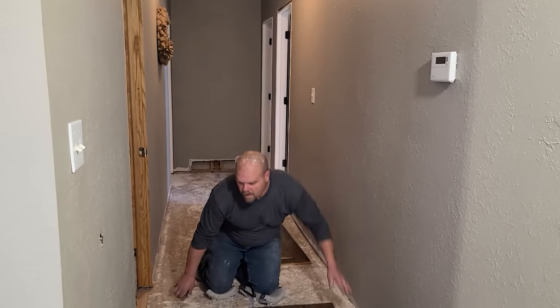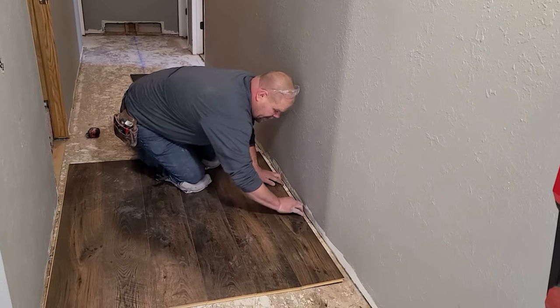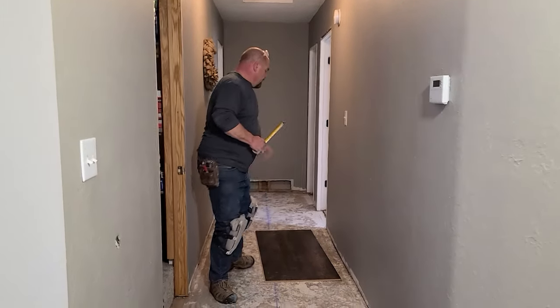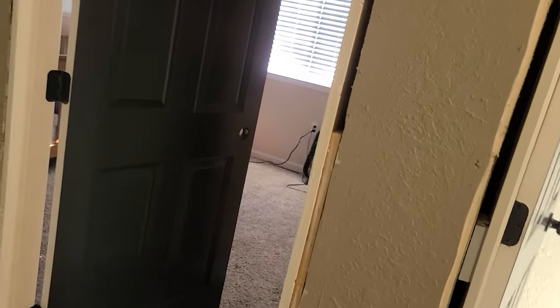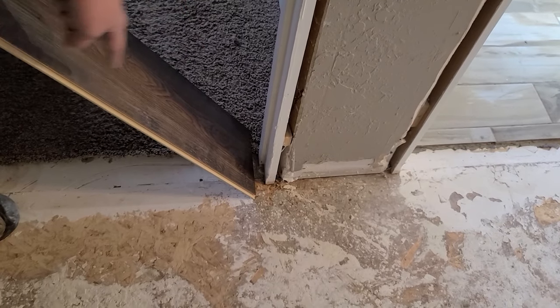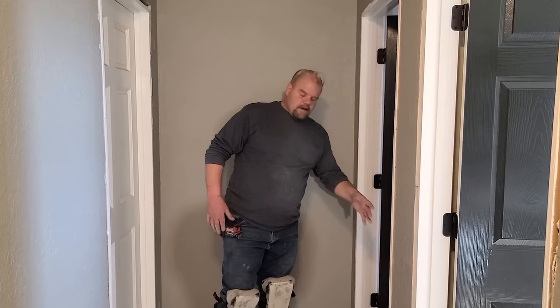To save you confusion, all I'm doing is trying to grow the plank so that we have a bigger piece, because if we center it, it's going to have a small piece. Something I want to avoid: if a plank stuck out an inch right there at the seam going into a bedroom, I would then have to wrap that plank around both sides of the door jamb at one time, and I really don't want to do that. By moving this over the half a plank, my plank is going to end up being about halfway in the door. It's better to end a plank inside the doorway — the long part of the joint — than trying to go around the whole door jamb with one plank. That's another reason why you want to adjust your hallway.